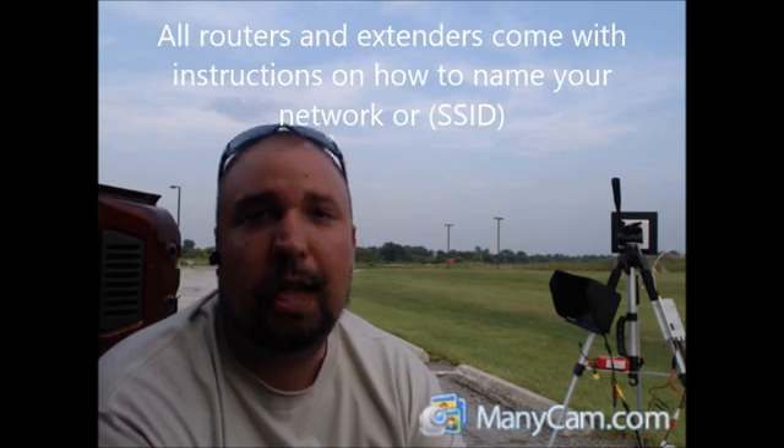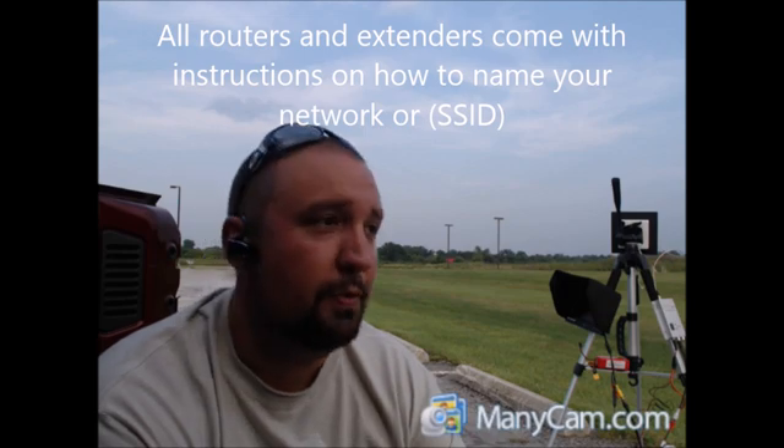You can do a YouTube search and find all the different videos people have done. The camera's Wi-Fi network is basically 'FC40' plus the MAC address of the camera. You name your Wi-Fi extender 'FC40-whatever' and add a zero or one to the end. You log on with your phone to the extender, and it automatically links up with the camera. It's not perfect — it takes some fiddling — but the Wi-Fi extender is around $100, and you might find one cheaper on eBay. The antenna was like seven or eight dollars.